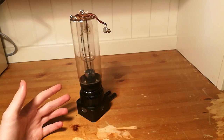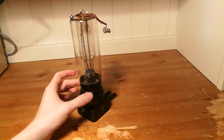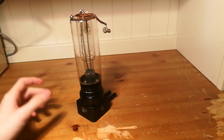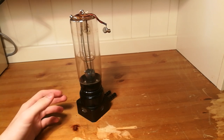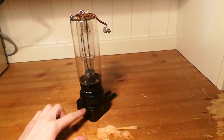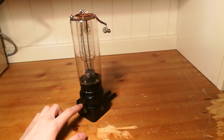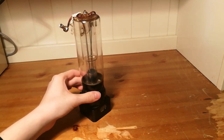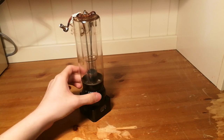This is the BSV-10 X-ray tube. It's a structural analysis tube, also called a diffraction tube, as it utilizes a very low energy output in the X-rays, which are emitted through beryllium windows. So in this case, we're making a lot of X-rays — an absolute huge amount — but with a very low energy in each of them.